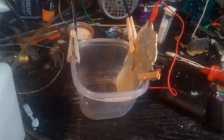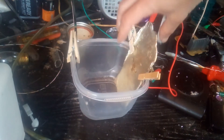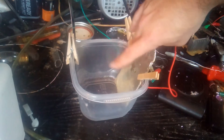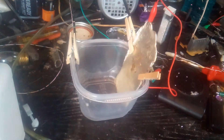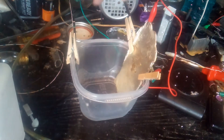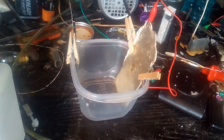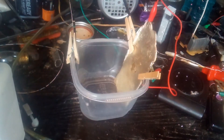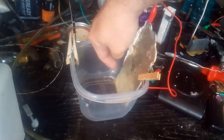Here's the setup for the electrolysis. I have the tin-antimony anode over here. I have a steel cathode over here — just a random bent-up piece of steel. That's set up as the cathode and that's where the tin is going to electroplate out. As the tin goes into solution and plates out on this end, the antimony should fall and make a pile of crud at the bottom.